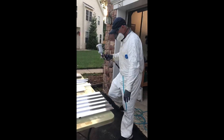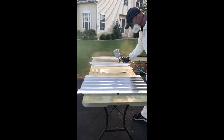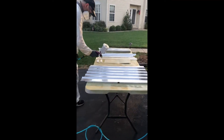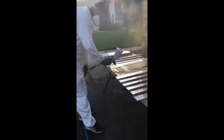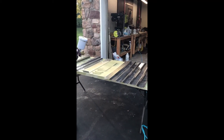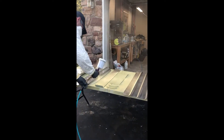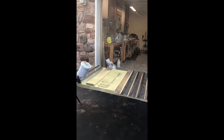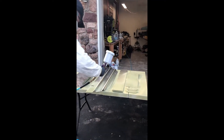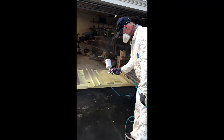Like I said, 55 psi is what I run it at. I'll do a couple of sprays just to see how it works. There's a little bit of overspray there — I was getting a little too close. Generally what works the best is a bit shorter than that.